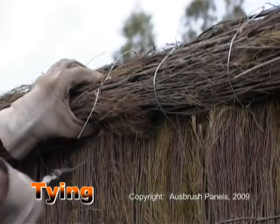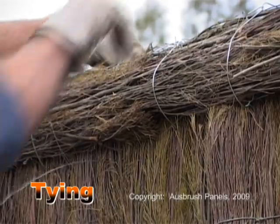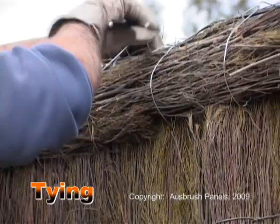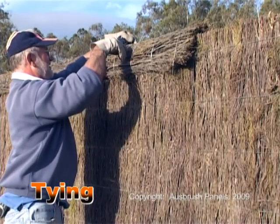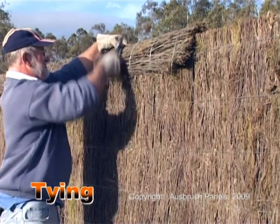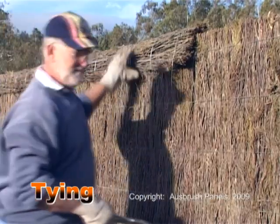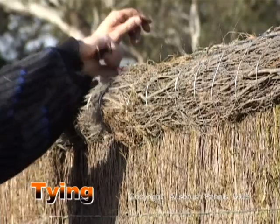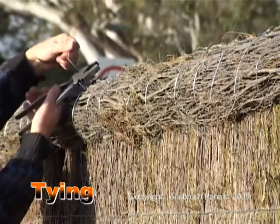The roll wire is drawn through the fence, releasing all the small sacrificial tie loops that hold it together. It is then tied at the top with the corresponding wire from the other side. A simple crossover bend at the 180 degrees rather than twisting is the best method to tension. This can be retightened or loosened to adjust the roll size and shape at the end. The wire ends are then finally trimmed off to approximately 1 inch or 30 millimeters in length.